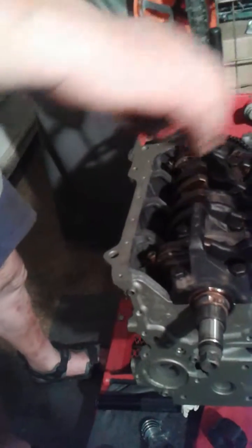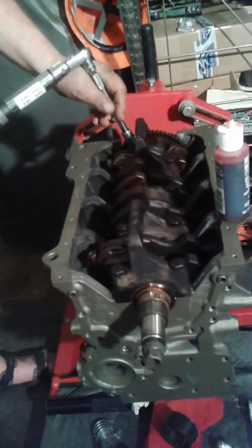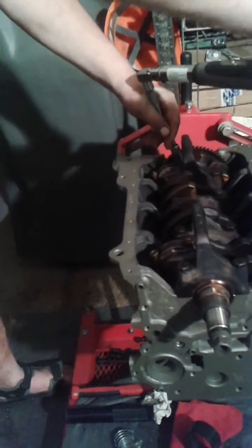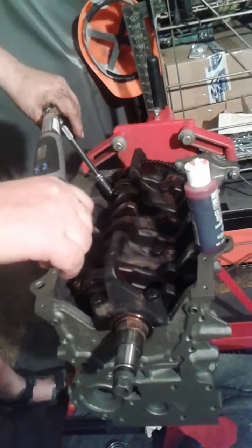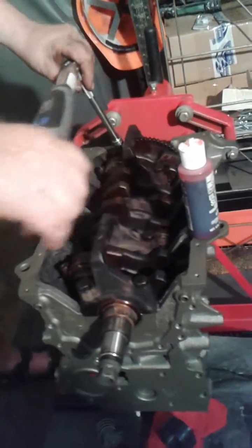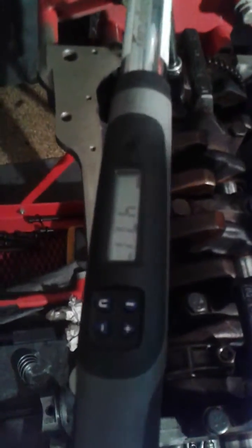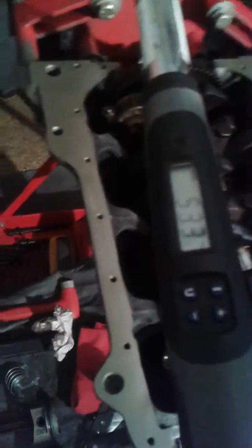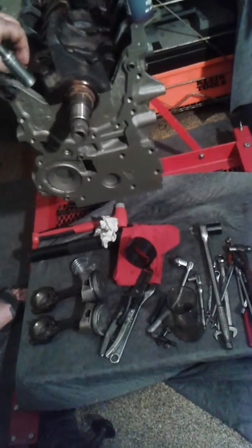Oh, it makes a beep? I was waiting for it to click. It gives a beep and a vibration. So it's different than the click we did before. Yes, this one is a little more accurate. Don't do it too long because you'll over-stress it. You can see by the digital readout it'll reach right around 53 plus or minus, which means the torque is good.